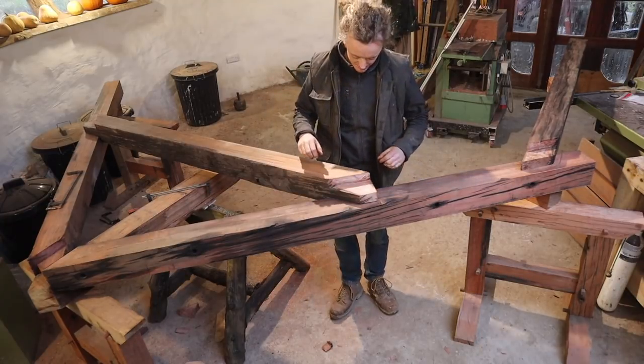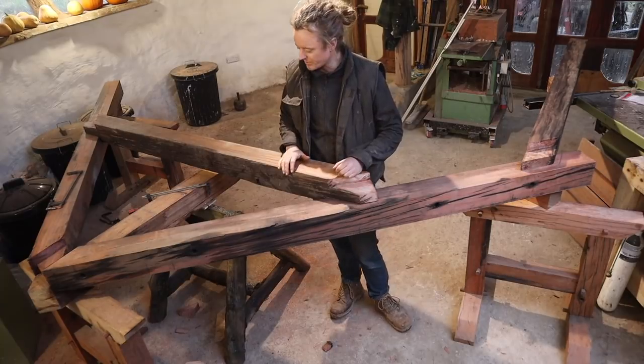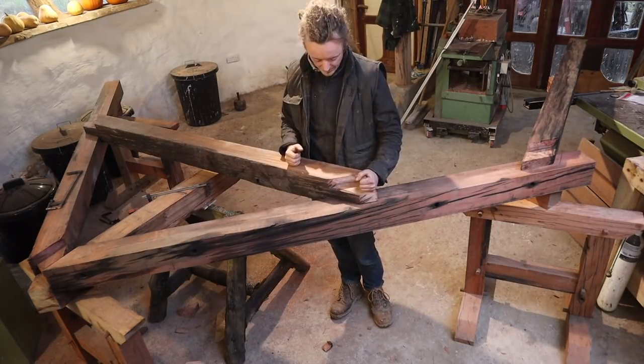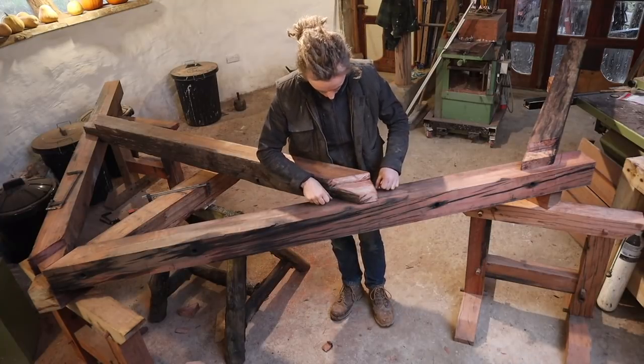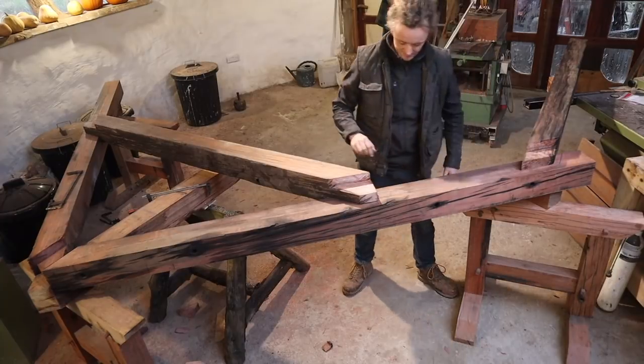So, yeah, I'm not gonna house these joints. It's just gonna be the tenon, because this is actually a pretty small building made out of big timbers, so this is plenty. If I was worried about the size of these timbers or it had a large load on it, all of these joints would want to sit so the whole width of the timber was in here somewhere. Same for these, but it doesn't matter.